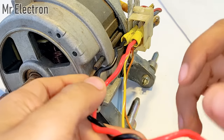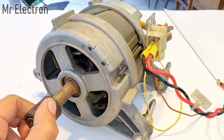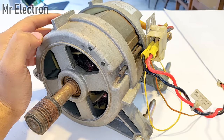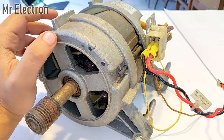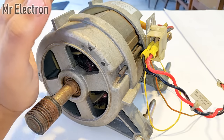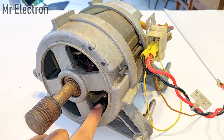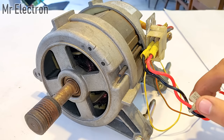To use this motor as a generator, I will power up the field winding by giving it some voltage — like 2 to 12 volts DC. I will be giving DC to the field winding to create constant poles: if this is north then this is south. The poles are here and here, and if this is north then this should be south — constant — and the generated electricity will be extracted from the armature winding.